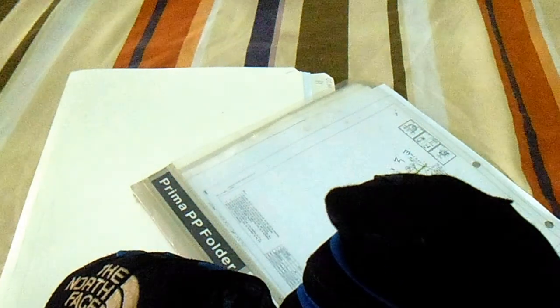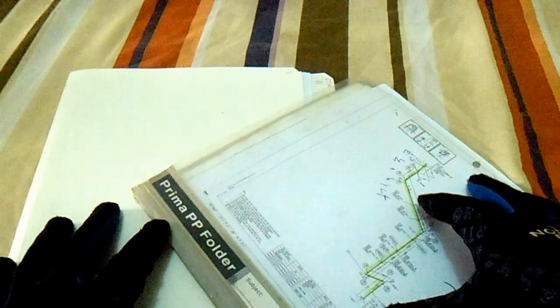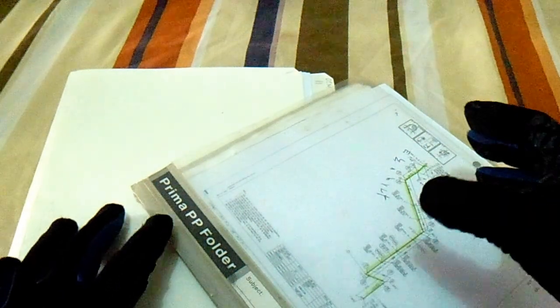Also, the WIR — the welding report — must be completed. The welding history and then the NDT must be satisfied. If RT is required at 100% or 5%, PWHT — post weld heat treatment — and PMI must all be completed from this test package, meaning the document series must be completed.